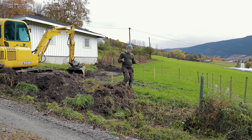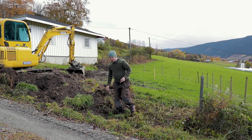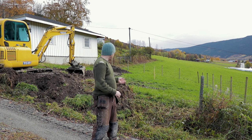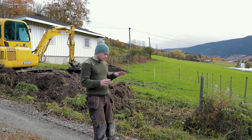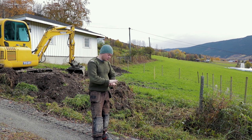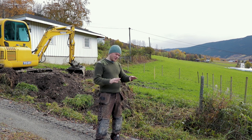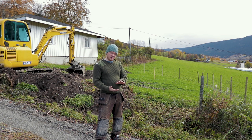What that means is I'm going to be digging way down below the frost line, which here is about a meter, so I'm going to have to dig down one and a half to two meters — a little bit shallower on the upper part. The idea is to dig down to get a flat surface, put in some small rocks, and put in pipes. I'm going to have a substantial pipe system about one and a half to two meters below the soil surface.